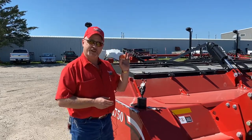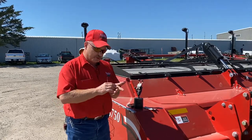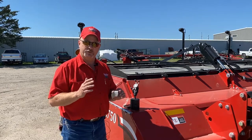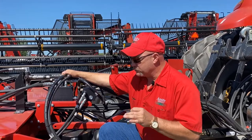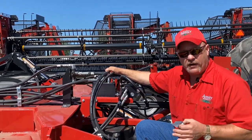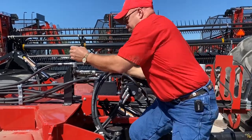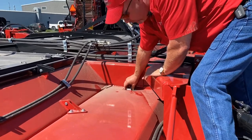We're going to secure this little device to the top of our topper. We're going to tape it down so we have good contact to the metal. We try to position it right above the center bearing as close as we can. Then I'm going to go to my phone, bring up the app, and connect this little sensor box to my phone so we can get our reading. There it's taped down, secured good to the frame of the defoliator.